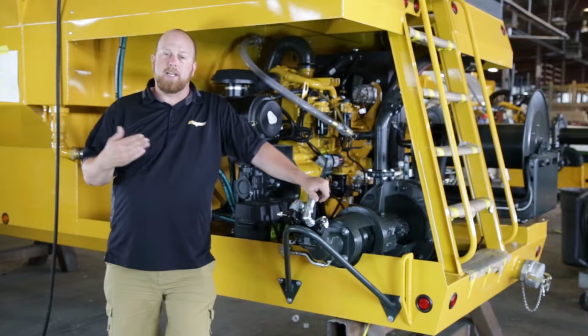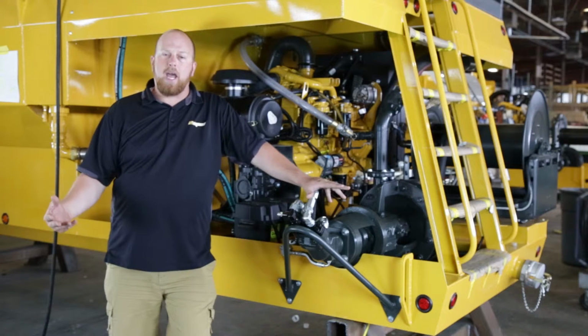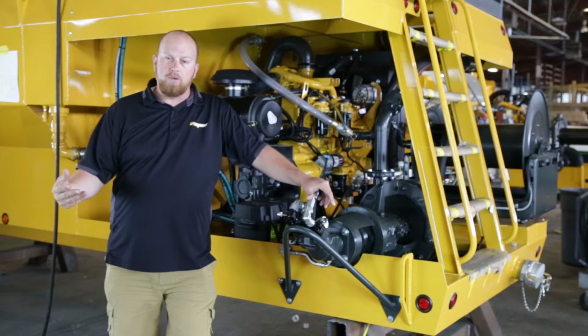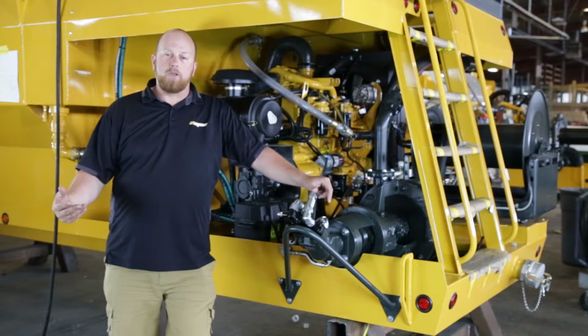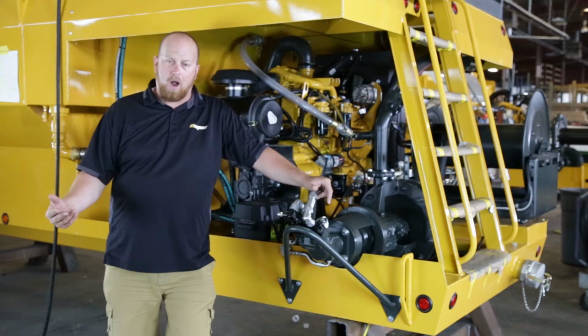One of the big ones is that it's not prone to cavitation like a centrifugal pump. Cavitation happens when you run the paddles too fast with a slurry that contains tackifier or thick wood mulch. Air gets into that slurry when the paddles are run too fast. With a centrifugal pump, that can cause problems. It can cause cavitation, which basically means that the pump loses prime.